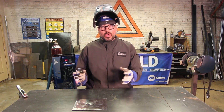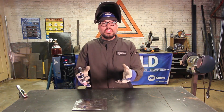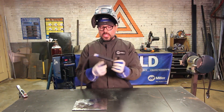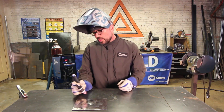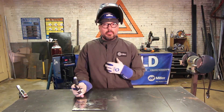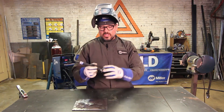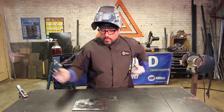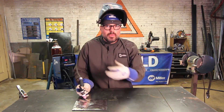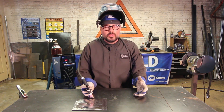Personal preference is normally in consideration of being comfortable. Some people get used to having the hose pulling on their hand, but my personal preference is to boa the hose around my back. That takes the weight of the hose off my hand — my shoulder takes most of the weight, so I'm not fighting the hose as I move through the weld. It helps a lot.